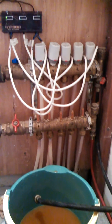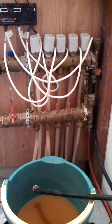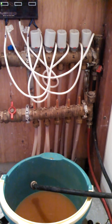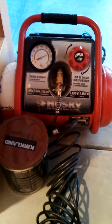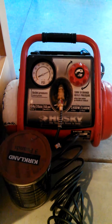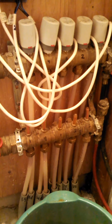This is Matt. I'm going to be going over a couple of tools that you're going to be needing while you're depressurizing and finding a leaking radiant system. One of the most important tools is your air compressor. As soon as we isolate the circuit that is in question, we're going to be hooking up and taking the water out of each circuit, circuit by circuit.